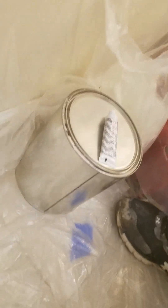I've got this fiber on here. Gotta wait for it to dry a little bit. I'm going to hit it with a grinder and block it out with some 36 grit paper or 80 grit — make sure that's smooth. Then hit it with one more pack of the filler we got, sand that down, maybe one more time with the filler, sand that, then we're going to match and spray some gel coat.